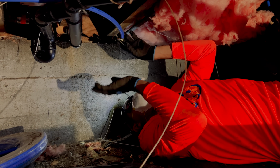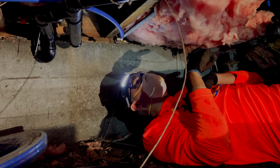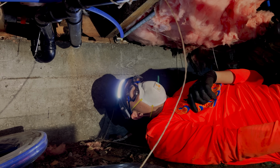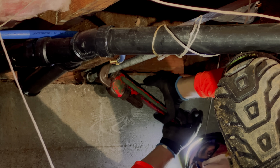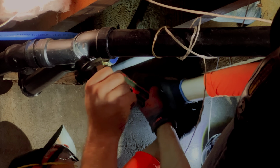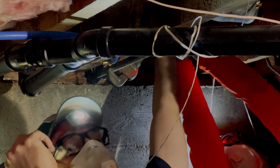Next. So we'll leave the faucet off, but we got to carry going forward to the toilet, essentially. Yeah, which we didn't change. I don't remember cutting the toilet line, but we must have. I don't either. Luis and I realized that as we were demoing the plumbing, we never saw the toilet, and we assumed that this just went to the outdoor faucet. But we discovered that this pipe actually leads to both, and it's in the wall. We'd have to take out the wall behind the toilet, which I don't want to do. So we're just going to tap into the little bit of galvanized plumbing that's left in this wall.